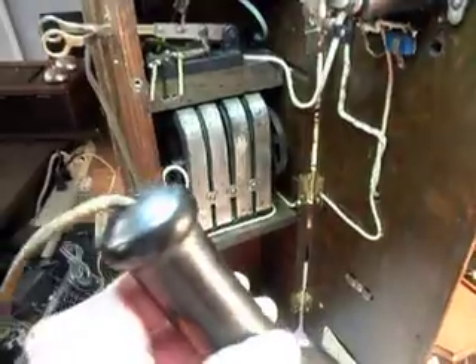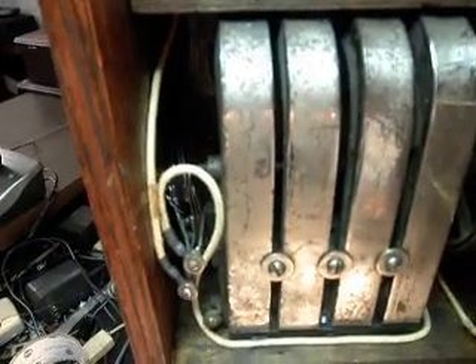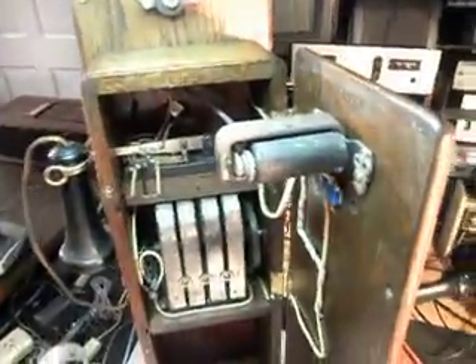The transmitter has all the original components on the inside, so everything on this telephone is basically original — the bell, the crank, and the receiver. We showed in an earlier video that we had to add a switch back in the area of the crank. It's actually attached to the crank because you have to mount it to the crank so that there is no movement, because the switch is very touchy and it has to engage every time. Every time you turn the crank you can see that working in there, and that activates a switch which breaks the actual ring cycle off the line.